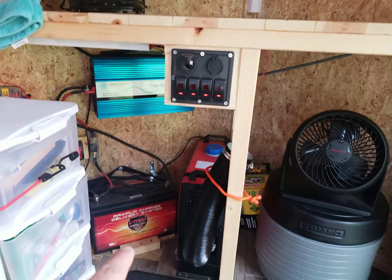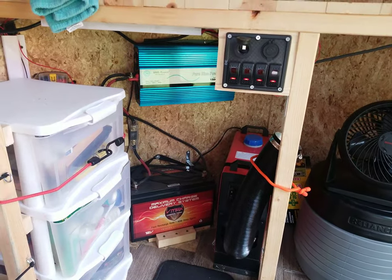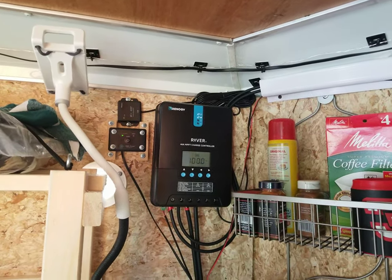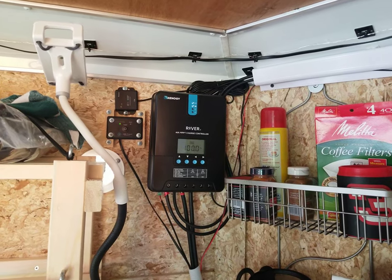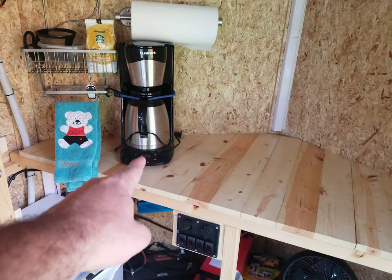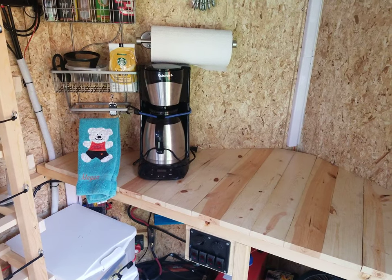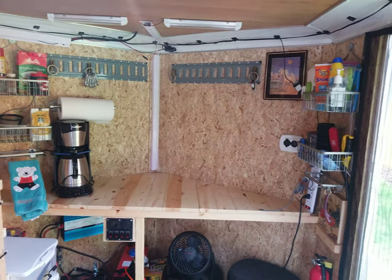I have a 125 amp-hour AGM battery below that, and a 1500-watt pure sine inverter — all being charged and powered by my Renogy Rover 40-amp MPPT charge controller. I have 200 watts of solar on the roof of the trailer, which powers everything. That gives us enough juice to power a 12-cup coffee pot every morning when we wake up camping. Honestly, the size of the battery and solar system was designed around powering that coffee pot. Our overall goal with this build was to be super quick, super efficient, and able to just go.